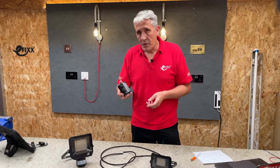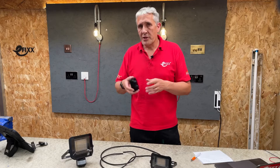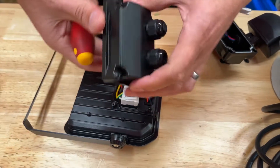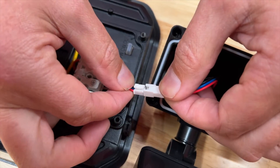Another great feature with this junction box arrangement is it's easy to convert any of the fixtures in the range to PIR operation. Simply swap the cap for one with the PIR sensor, remove the jumper link, plug in, and the conversion is done.